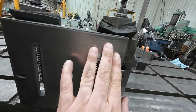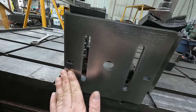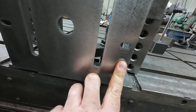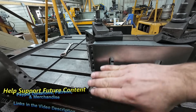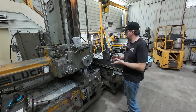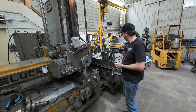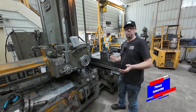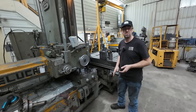Well, that came out pretty good, and it's cast iron so it never looks perfect, but it sure feels smooth. It came out absolutely beautiful — I'm actually surprised. You can see it kind of looks like chatter marks but you don't really feel anything. It's weird, but at least it's flat now. If I throw the straight edge up there — and I did it off camera — it is absolutely beautiful. Flat now, so he shouldn't have any problems with this whatsoever. I hope you enjoyed the video running the fly cutter on the horizontal boring mill. I couldn't think of a better way to do this — something odd, just absurd, really. I could have done it on the Bridgeport, probably would have worked just fine. Could have done it on the planer, probably would have worked just fine. The Cincinnati horizontal — but got a boring mill, why not? It's beautiful. I think he'll be very pleased with this. At least it's flat now, which he didn't have before.